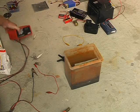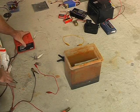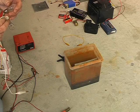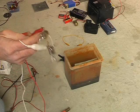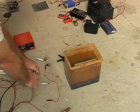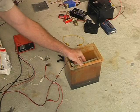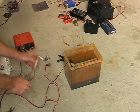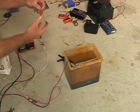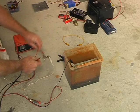The next thing we're going to need is a battery charger or just a 12 volt battery. I've just got a little 12 volt battery charger, about $19.95 from your local department store. And you're going to need a couple of tail light bulbs from your favorite vehicle — these are five watt bulbs. Two five watt bulbs connected in series with a few wires or alligator clips — very simple. Here is our piece of stainless steel immersed in the water, connected to the negative terminal of our battery charger. The positive wire now goes off to one side of these two bulbs wired in series. If I touch this on the negative, the bulbs light up — both bulbs light up — that shows us that the current is flowing.